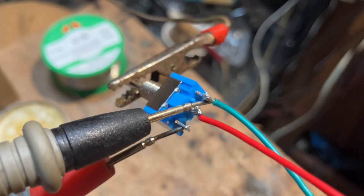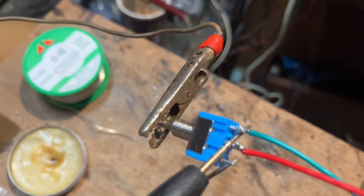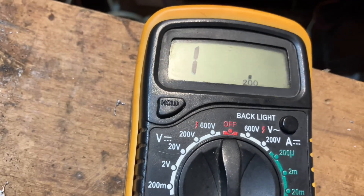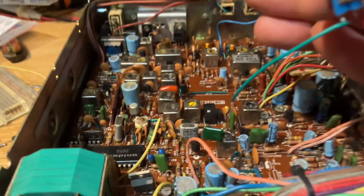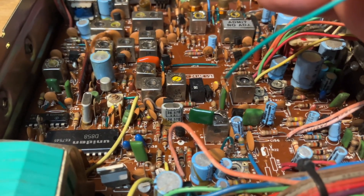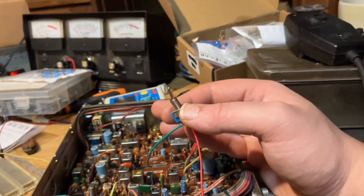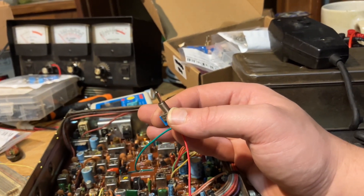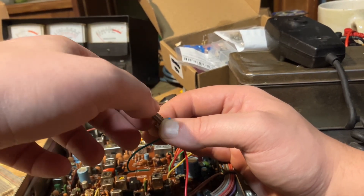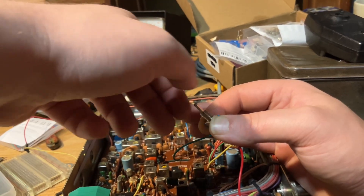When you do this, remember it's best to use a multimeter to check for any shorts in the switch after you've soldered, because if you spend too long soldering you can damage the switch. Looks like there's no short here, so we're going to go ahead and try this out. I have the switch hooked up, and I did reduce the capacitance — this is a 0.047 capacitor. I'd still recommend the 0.068, but this will reduce noise a little less, just because I didn't want to clip out voice. And as you can see, it's still working very well.